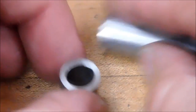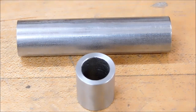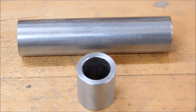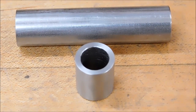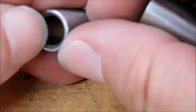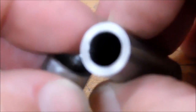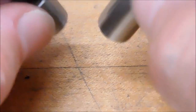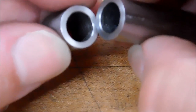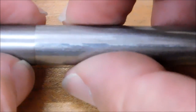All right, this is when we get creative, and I highly suggest that you heat treat these pieces. Do it with a water hardening, oil hardening, whatever kind of steel you want to use. Heat treating this is a really good idea. And if you can't heat treat the entire thing, then case harden the flat sides that you've faced off. You have one chamfered side that's going to accept the screw and one flat side. You can case harden these pretty easy: get them up cherry red, dip them in the caseinite, whatever, and then rub them out on a piece of emery cloth so that they slip real nice. I bet a lot of light bulbs just went on, huh?